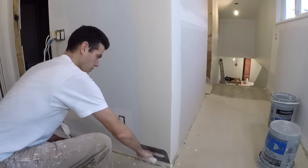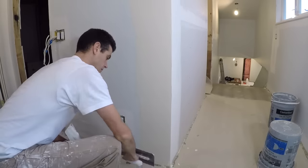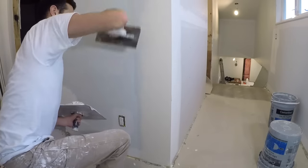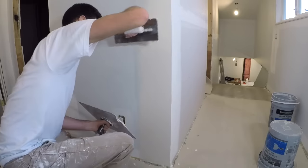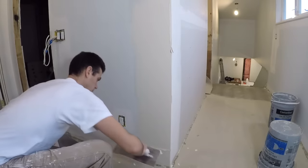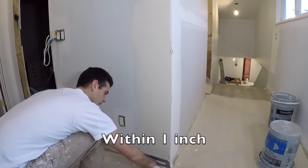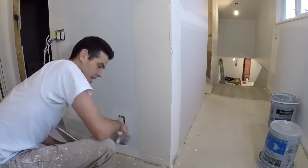This side is bubbling like crazy because it's on a painted wall, so I think what I'm going to do here is skim this tight first. And now I'm going to coat it again. It's important to go down as close as you can get to the floor without making a mess, and to also make sure that you don't leave a big blob at the bottom — we call those baseboards. You don't need to be adding baseboards for the trim guys.